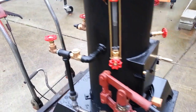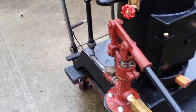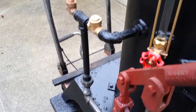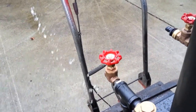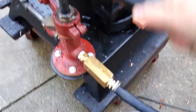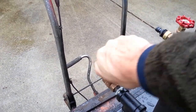The pump here is working real good. It's got a 1-inch ram on it, and it's all bronze on the base of this one. This is the airlock — in case there's an airlock in the pump itself and you can't get water up through it, just open that up, then close it off and everything you pump from there on out goes right into the boiler.